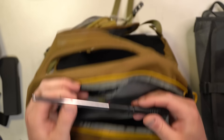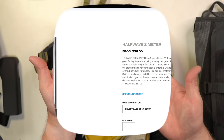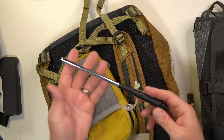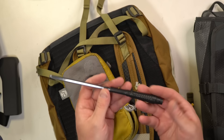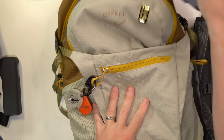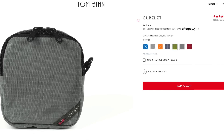In the laptop pocket I also have the Smiley one-half wave vertical two-meter antenna. This is a great antenna for two-meter simplex or doing Summits on the Air — I always keep one in a backpack to switch to when I get to the summit. It makes things really portable. One important note: don't leave this on your radio while hiking, as you will likely break the radio.